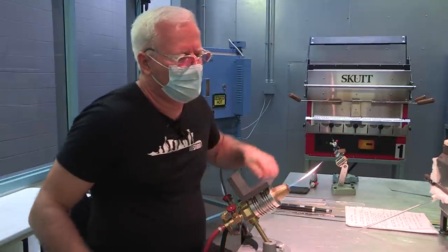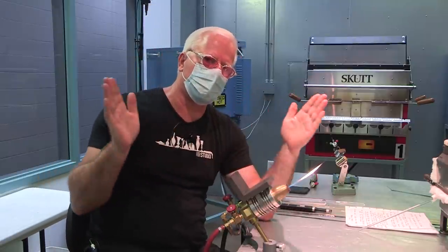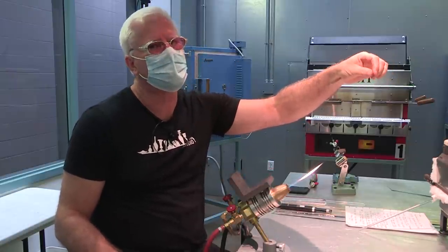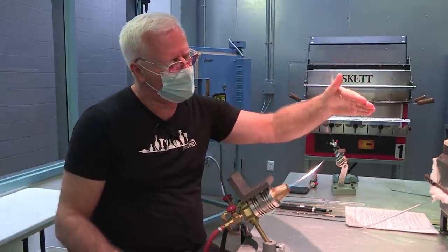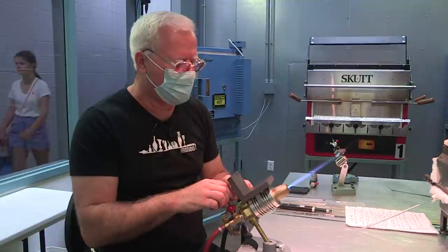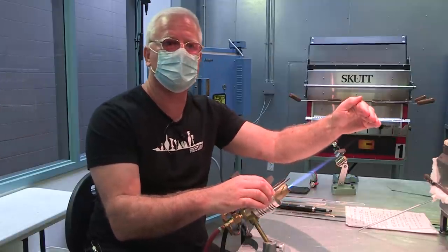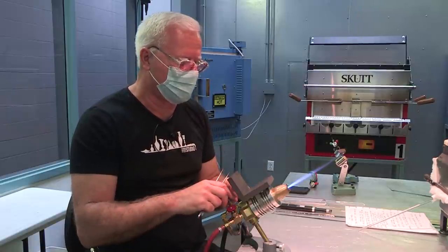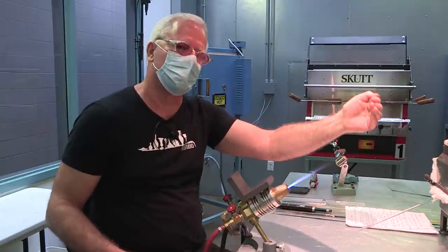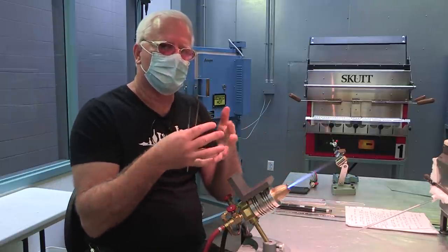So good question. In your oxidizing flame, what you're doing is you're suspending those crystals. And at some point, in order to make that spectrum bloom, you do have to cool it. So if you stay in an oxidizing flame and come out, you're going to cool it to some degree. But remember, here we are in a neutral flame. Right? So the base level at the candles right here is 4,000 degrees Fahrenheit, but up here, maybe 1,000 degrees Fahrenheit. But if you increase the oxygen, the temperature at the outer end is much higher. So you're really not ever getting to the point where you're consistently cooling it, bringing it down, waiting that 20 seconds until the majority of those crystals can then regrow.